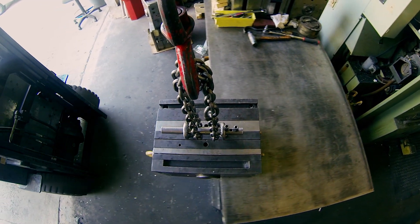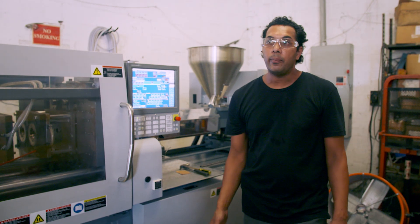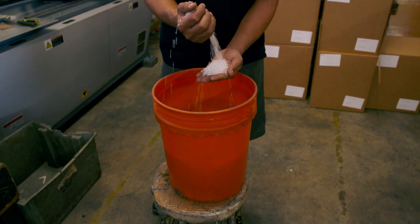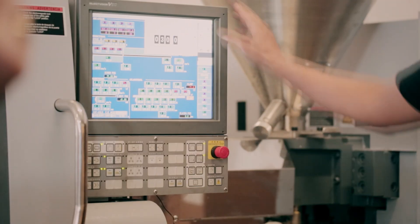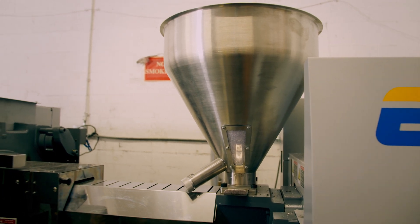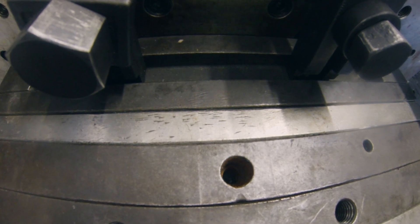It weighs over 200 kilograms. Our next step would be our raw material — little pellet forms. That's going to be melted and shot into the cavities to create your yo-yo. The machine melts the pellets at 260 degrees, then pumps the molten plastic into each cavity. Too much or too little in each mould and the yo-yo won't balance.